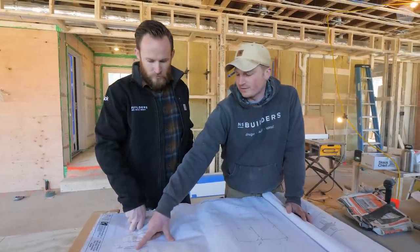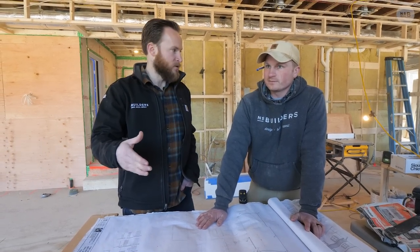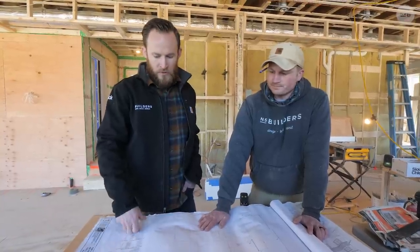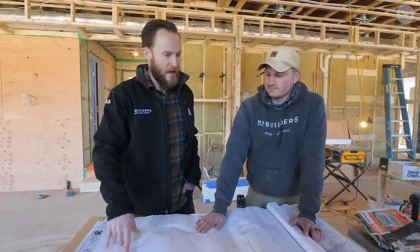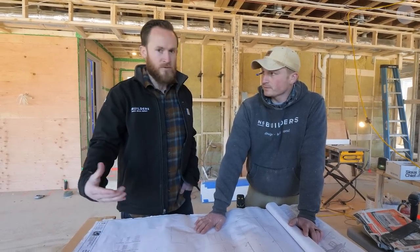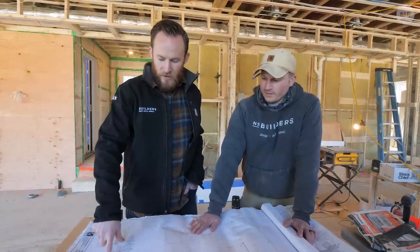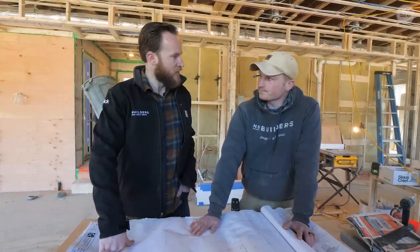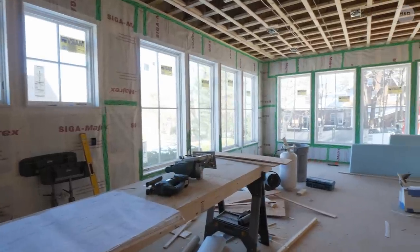On the interior face they're allowing the half-inch gyp to act. We actually used Advantech sheathing which is half-inch — a little bigger but it's also a structural panel. So we're not over-engineered but we chose to make sure we hit that plus. This is also saying we just need half-inch gyp board, which in our case is blueboard since we plaster here in Mass on the inside, and unblocked. What we have to pay attention to is the fastener schedule on the exterior. That's why we see that wall still has a vapor barrier.